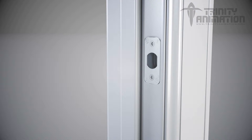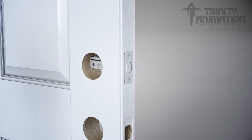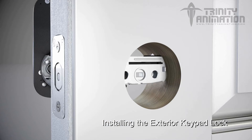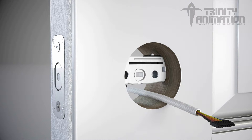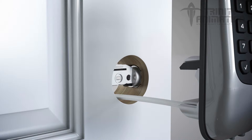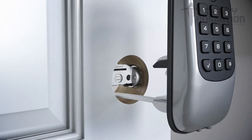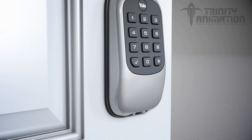Next, we will install the exterior of the lock with the weather-resistant seal. Make sure you guide the control wires under the latch. Next, position the bolt in the correct orientation to engage the tailpiece. The bolt must be in the retracted and unlocked position. Please note the horizontal orientation of the internal mechanism that will allow the deadbolt to slide into place and properly engage the latch.